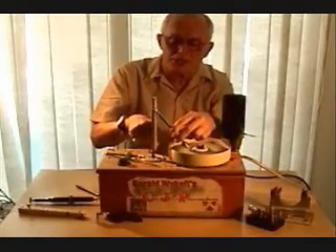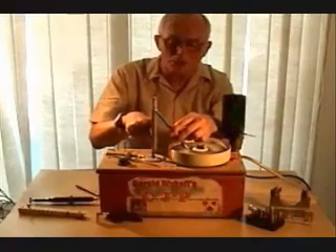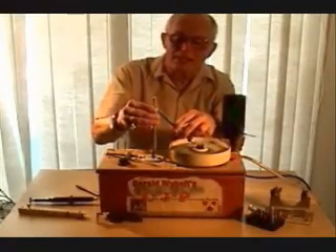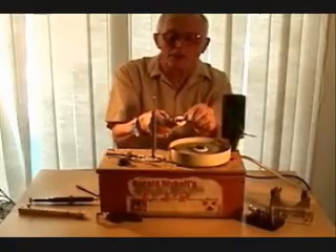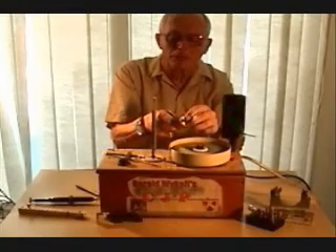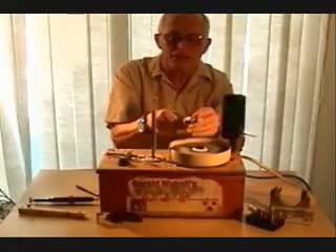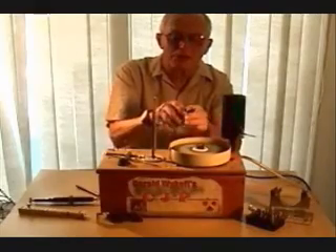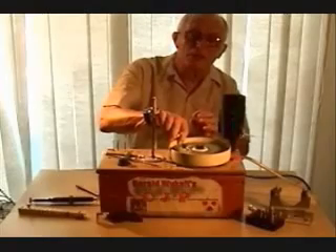As the angle changes, the adjacent side reduces or lengthens — and that's what the calibrated jam peg is. The indexes are controlled with an index gear and a trigger. You merely turn it for the number of facets you want, slide the trigger into place, place it into the proper angle, and go ahead and slot.